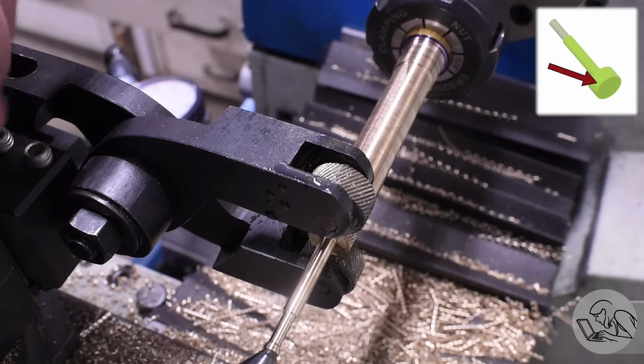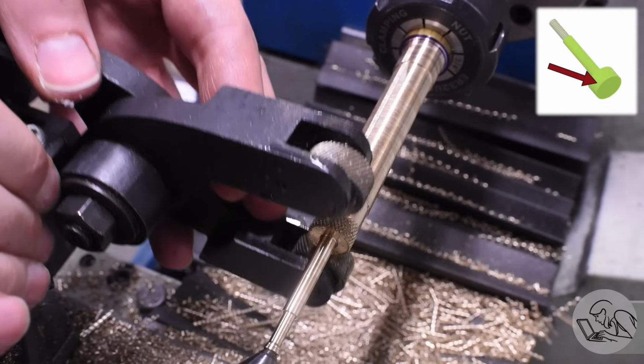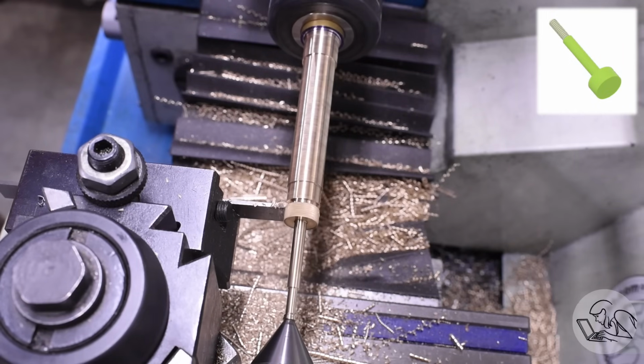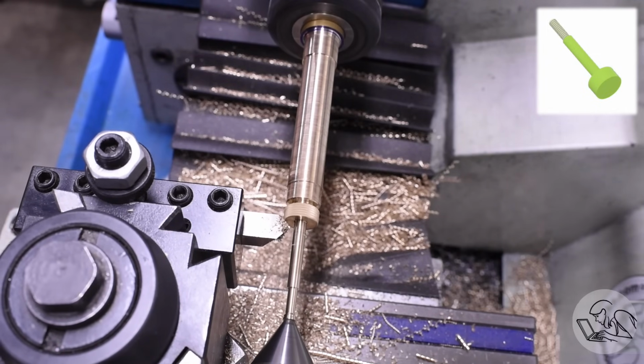I was, am, and perhaps always shall be a mediocre knurler, and this is no exception. That is, in fact, a mediocre knurl. However, here's a little trick that makes any knurl look a whole lot better. Chamfer both sides of it. The material gets pushed over the sides there, and a classy chamfer will clean that right up. It is quite surprising how much better a chamfer on both sides makes any knurl look.